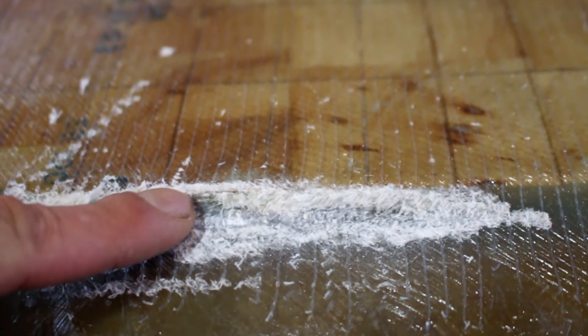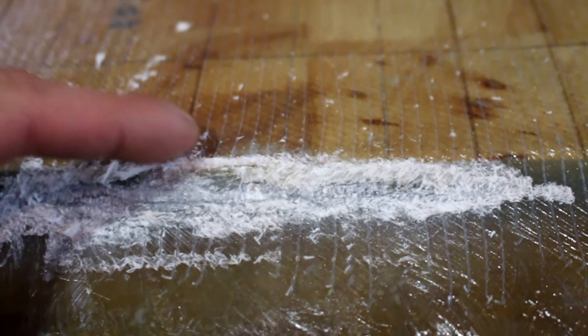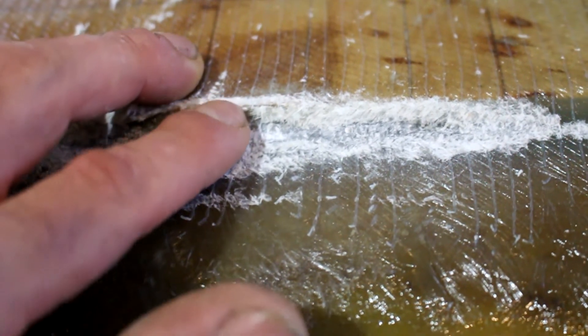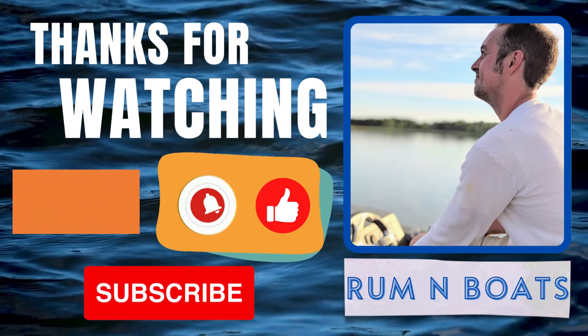You can see my failure here — where it didn't laminate was on this edge. The thickened resin I put in was about a sixteenth of an inch low from the top of the coring, so we ended up with a flat spot and my matting didn't want to go over that hard edge. Everywhere I actually got the thickened resin right — which is the rest of this — came out nice with no air. But where it wasn't thick enough I still have a void, and I can't just leave air pockets like that. Got to get them out.